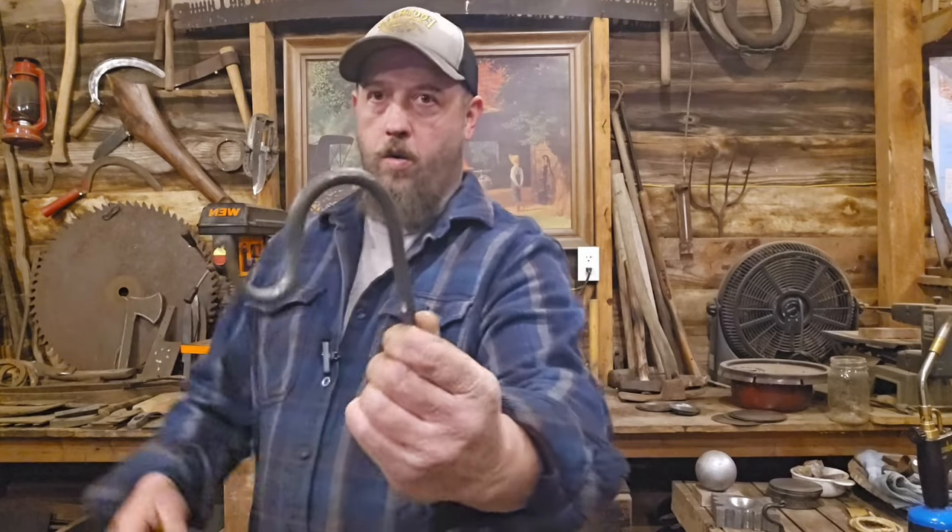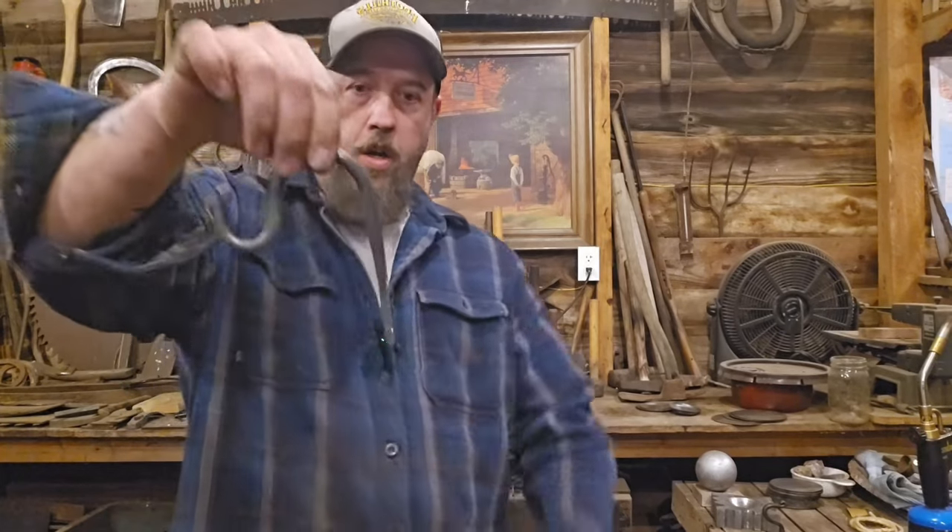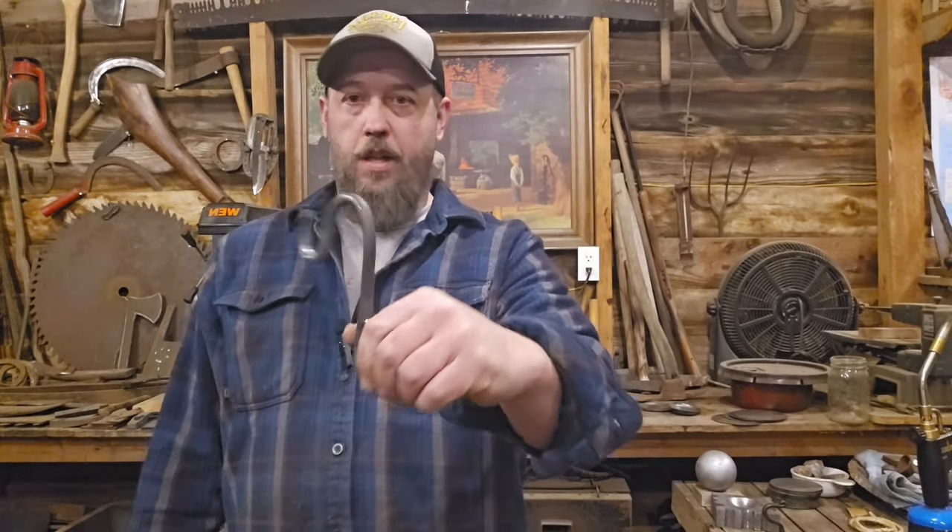One thing I did forget — you saw me throw the pipe off the jig. When you're making jigs, give yourself just a little bit more room, because the steel does expand when it's hot. It got hot in the forge, expanded, and wouldn't fit — but it all worked out. Here's our finished hook for the curtain rods, drilled and countersunk for the screw holes. They're requesting them left raw — they'll paint them themselves. That's how to make a jig and how to use it. I hope y'all enjoyed. Thanks for watching, have a good day.